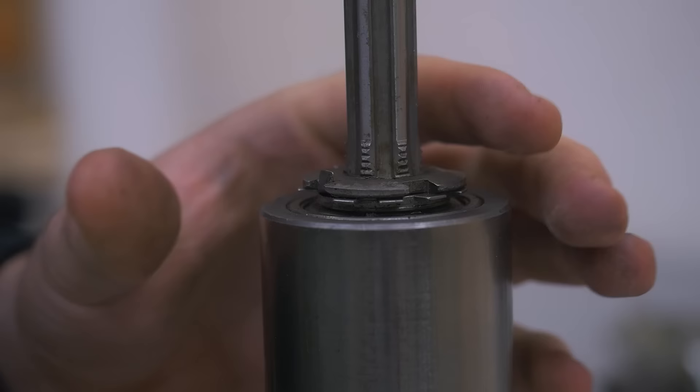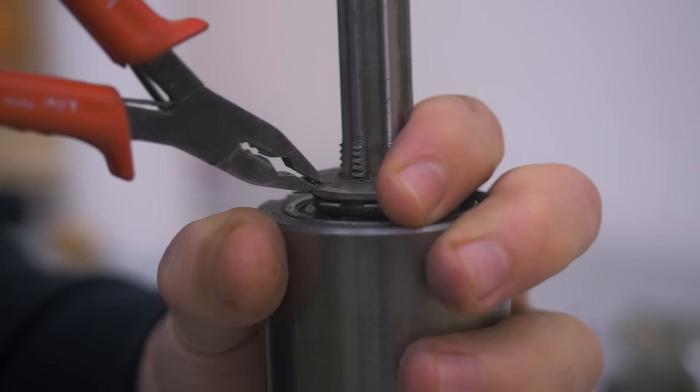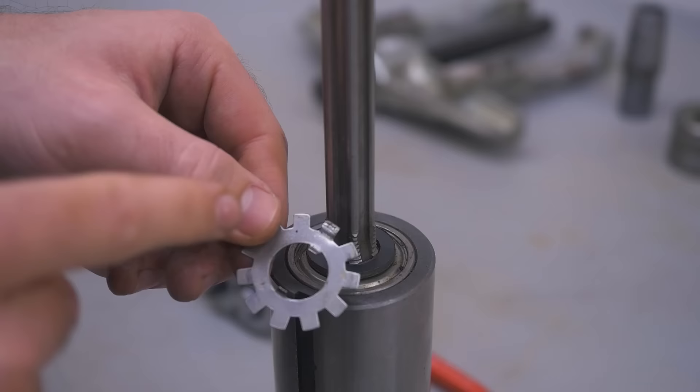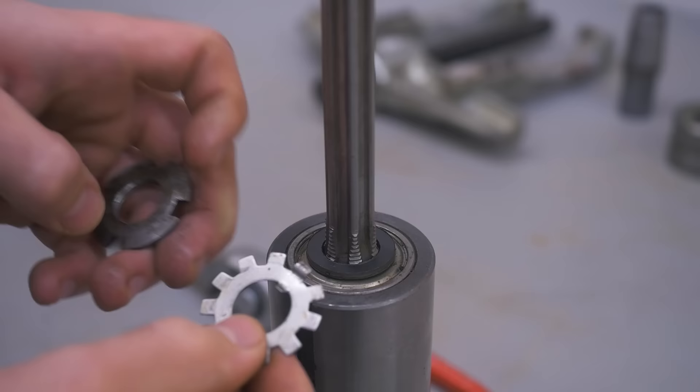It's not as straightforward here because there's this folded-over metal lip — it acts kind of as a lock nut. And tapping it open with a screwdriver is the best solution. The way this works, it also interacts with the spline shaft, and when you fold one of them into the nut, the nut can't unscrew anymore.